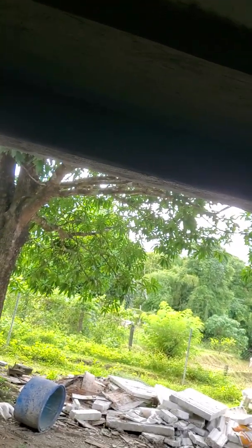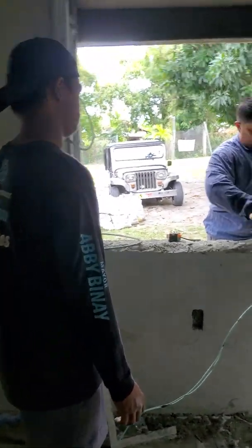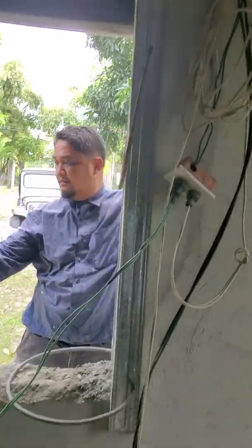Richard is doing some finishing work which looks great. This will be a four-by-four window area here. We used a laser already this morning to make sure it's nice and plumb. It's going to be a four-by-four PVC window plus maybe a quarter of an inch for play. He's putting up the C-channels and just working it across, using the edges for traveling to make it nice and perfect.